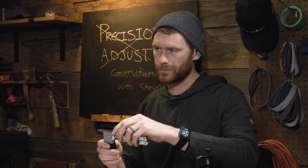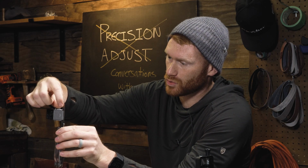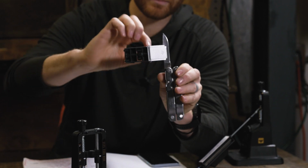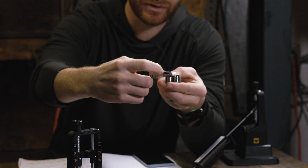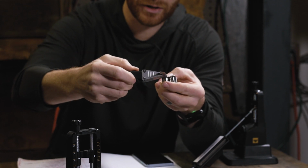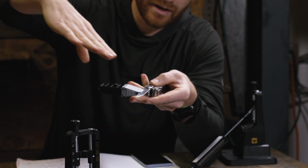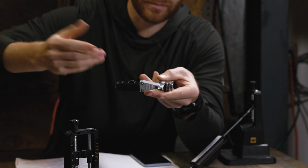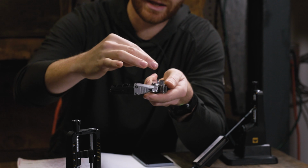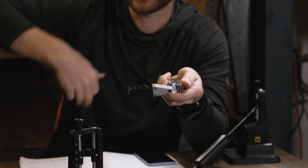I would share one tip with this, and that's that sometimes these multi-tool blades are very short from the spine to the bevel, and so if you back them out of that V block just a little bit, you can still get a really solid purchase on the blade. And that allows you to come in and get a shallower angle, sharpening closer to 20 or 25 degrees, rather than if you clamp all the way in, you're left only being able to sharpen at something really steep like 30 degrees. At a very high angle.